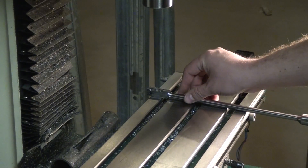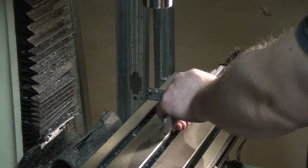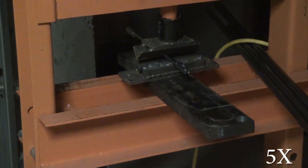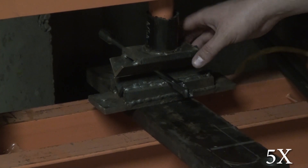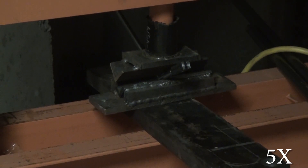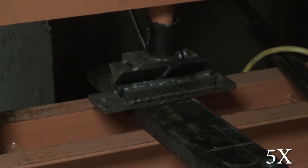As far as the bend, I just laid this across the table and then with a file marked a notch right at the center of the y-axis. This was actually a mistake — I should have marked a quarter inch closer to the indicator. The reason is when I put the bend in, I made the small part of the bend exactly half of the table, so the indicator tip is right on the far edges of the table when I sweep the y-axis. If I had left myself a little bit more room it'd work a little bit better. It's not causing any problems, but I wish I had gone about a quarter inch closer to the indicator. Anyway, there's the really crappy bend and that's the last step.